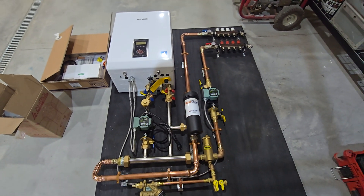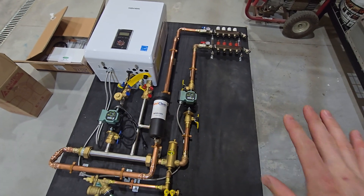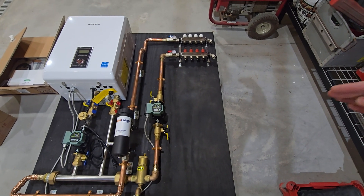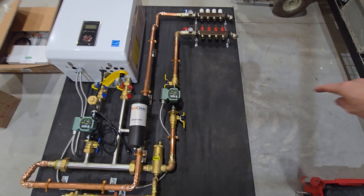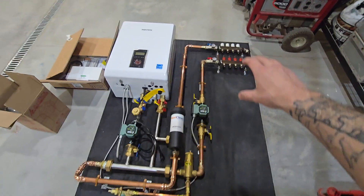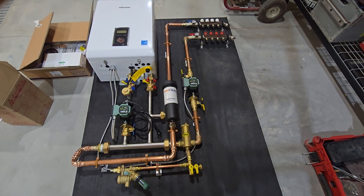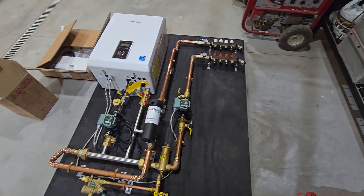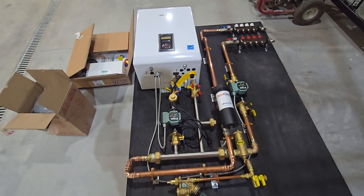The idea of this is there's an addition going on next to the basement where this will be mounted. The loops will be coming in through a new hole that will be cut in the foundation, and they're going to come in sideways and just loop right up into here. So that's why these are up top — typically these are down lower for going down into a floor, but in this situation it's going to work out perfectly. A good example of how we can configure these however you need them.